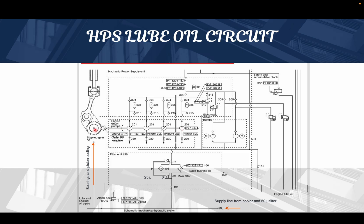The axial pumps are engine-driven — as you can see, this is the engine and through a gear arrangement it drives these pumps. There are also two electrically driven pumps. The oil at 2 to 4 bar enters the axial pump. These axial pumps are positive displacement type. Their main purpose is to develop pressure from 2 to 4 bar at the inlet to 200 to 300 bar at the outlet, depending upon the type of engine.